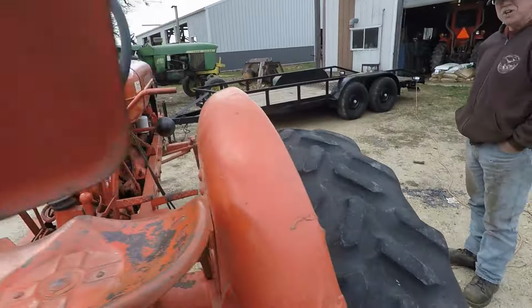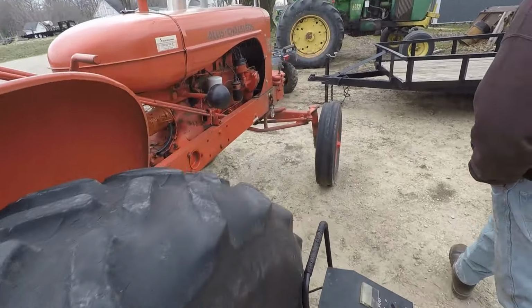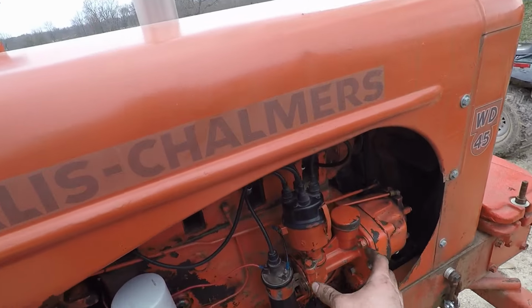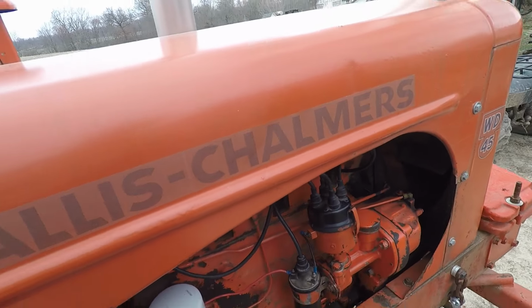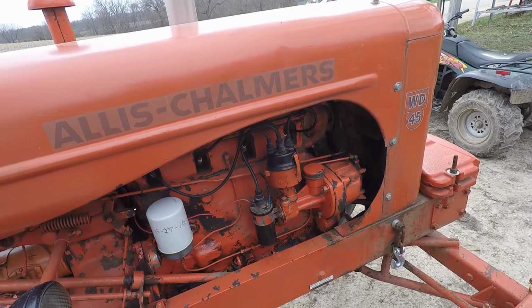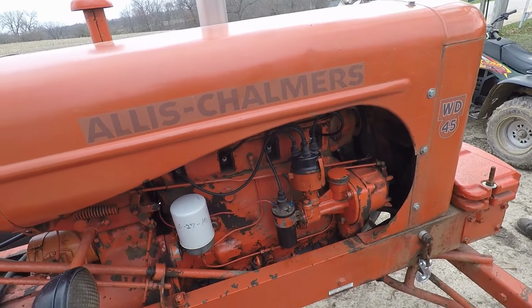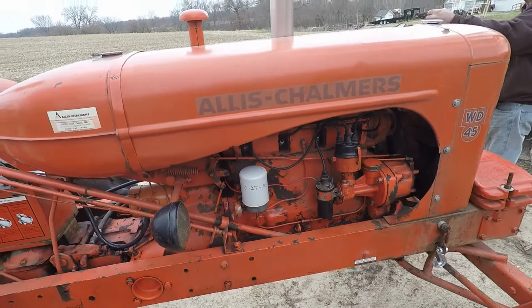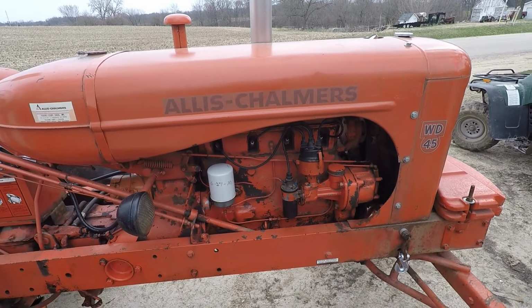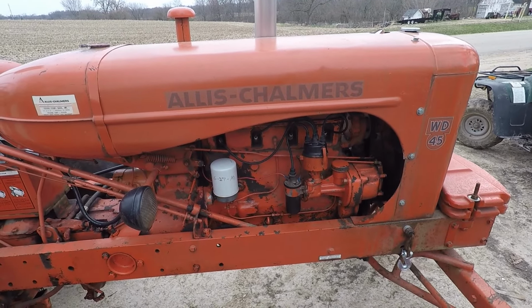Okay. Cool. Good. We beat it. Mission accomplished. Yep. So I set that shaft in there for 5/1000ths end play. I don't know if that's good or bad. That's good. It works, doesn't it? It works, yeah. I'm just real sure that nut had backed off some and we were getting this and this and this with the gear. Yeah, that sure seems like it. Yeah. So good. It runs. Yeah.